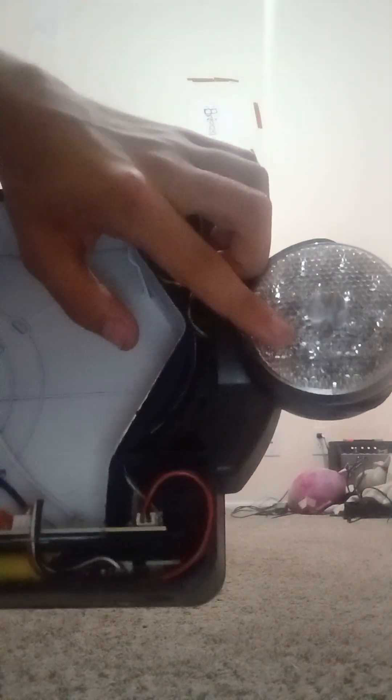Now looking at the wires: the orange wire is for 277VAC, the black wire is 120VAC, and the white one I believe is the positive wire. Right here this plug is called the emergency light plug. It connects through to the LED emergency light, so if it's connected to the wires it will work. If you unplug it, the emergency light won't function.